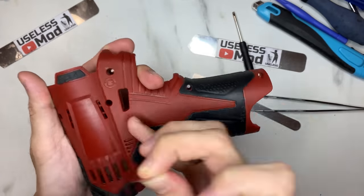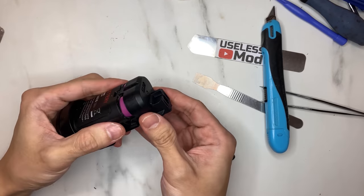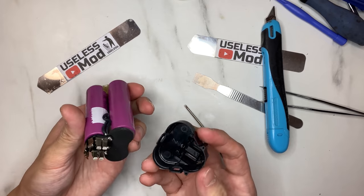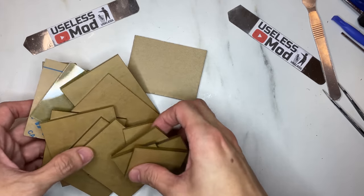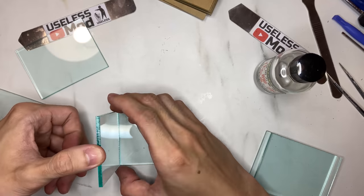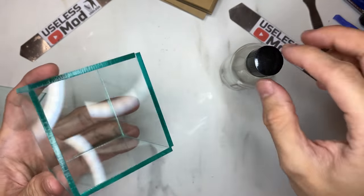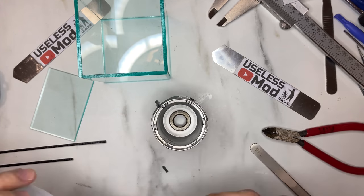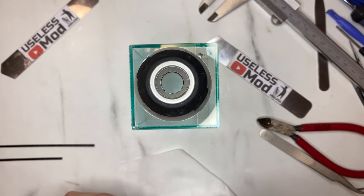Prepare the case for mold making. Tear apart the battery, remove all the stickers, and take out the top cap of the battery. I laser-cut all the acrylic boards for making the mold box. Peel away the protective film, glue all the boards together to make the box. Cut the acrylic strip into length and glue it onto the parts to make the runners. Stick the parts into a clear plastic.